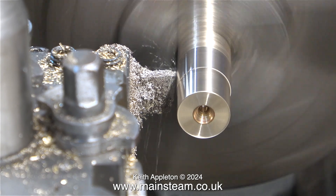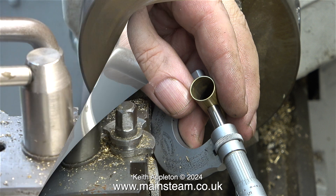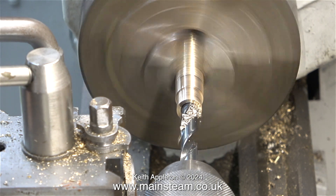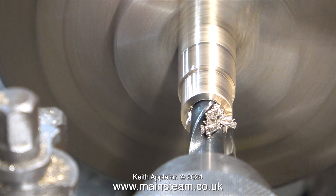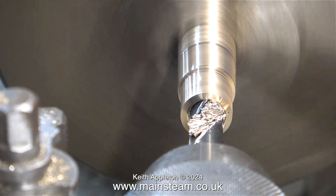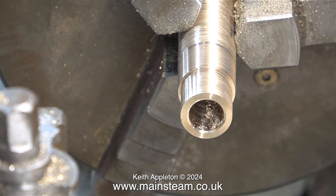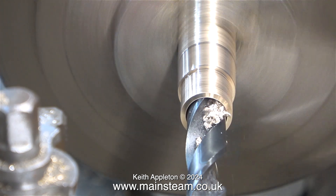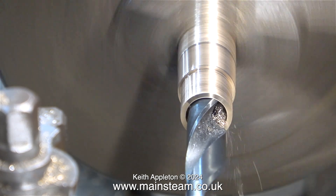At this stage, using my micrometer, I thought it was a good idea to measure the original flue onto which the chimney pushes. After doing this I turned the end of the flue to the correct diameter so the chimney pushed onto it, and the length of this — just as the original measurement — is half an inch. I now need to drill in from the other end using the same principle — a smaller drill bit first, followed by a drill bit that's not as big as the one I used at the other end, but I need the part to have sufficient strength to support the chimney. If I drill it too thin it could go wrong, especially during the silver soldering operation.